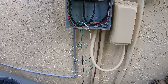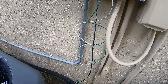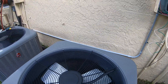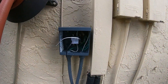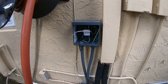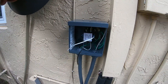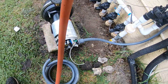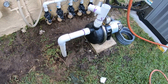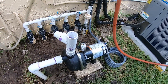So I roughed in the electrical. I ran half inch PVC schedule 40 — still have another couple clamps to put on — to this Monroe start box here. This is basically a contact relay. It's a 24-volt relay that's gonna get wired into the sprinkler timer on the master valve. Got flexible conduit going down here to the back of the pump. I did have the intake side of the pump plumbed up; I didn't do the output yet. I was gonna do that last once the pump is ready to go and primed.